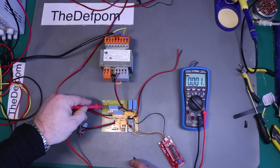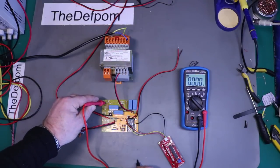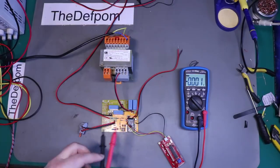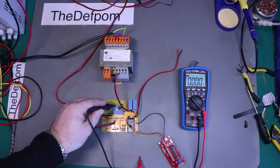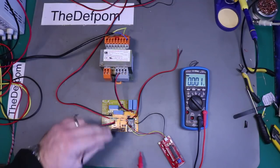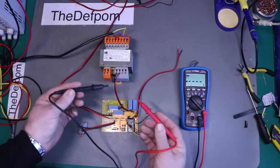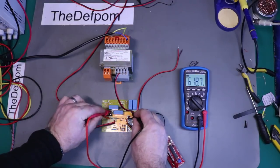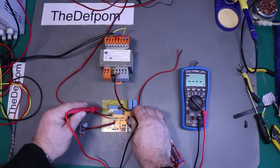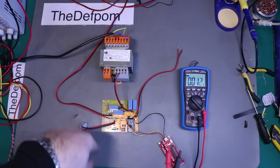The pot goes across as a resistor divider, which might get the voltage down, but that will create a voltage drop that could be problematic. I might actually redesign this board - if I just remove that one capacitor it will feed the voltage through the diodes directly to that point at the voltage I want. So if you want 600 volt caps this board is perfect for you; if you only want 500 volts, just leave that capacitor out. I'm going to redesign this board and simplify it by removing circuitry that's not being used.